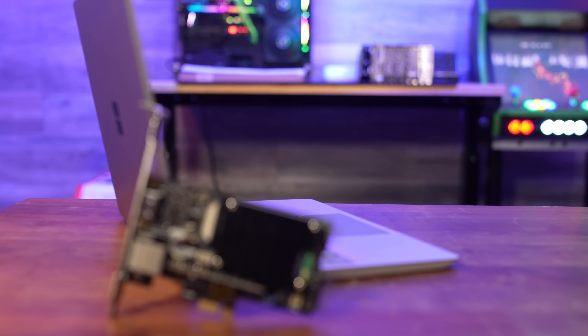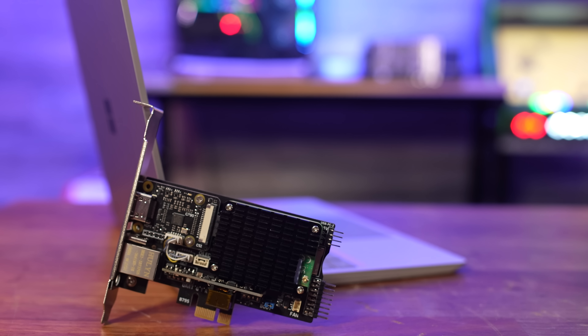I made a handy tutorial for getting that set up about a year ago if you're interested in seeing what it can do. On top of being less expensive than first-party solutions, running a Pi KVM system like Bly KVM means your deployments are vendor-agnostic. Your remote management isn't tied to the server hardware that you purchase. Whether you deploy a Dell or a Supermicro, your management interface can be identical across your entire environment or across multiple client sites. Not being tied to a particular OEM, along with using open-source software where possible, is something I always strived for when I was deploying servers for businesses.